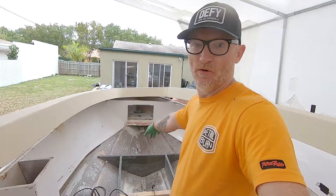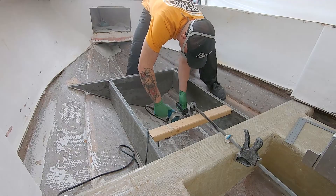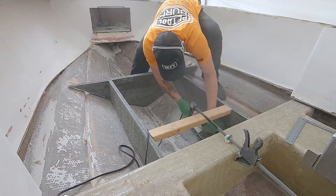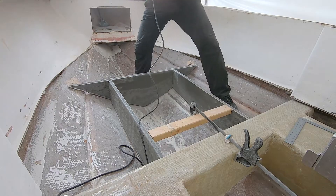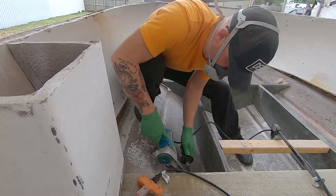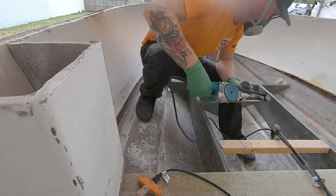These sections were pre-cut and laminated outside the boat on a flat table. There are two layers of 1708 on each side. I already did a lot of work on the hull cleaning it up and grinding, as you can see. Here I'm just taking my belt sander and going back again, making sure all the areas where I'm going to be laying glass are perfectly clean. You can see where the original stringers were bedded into the hull.